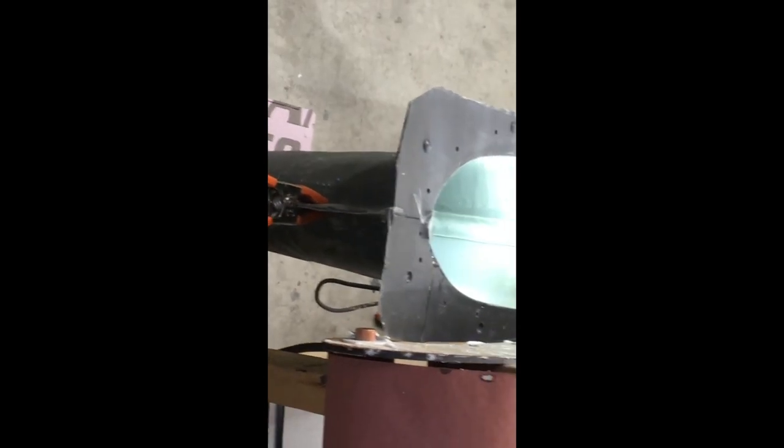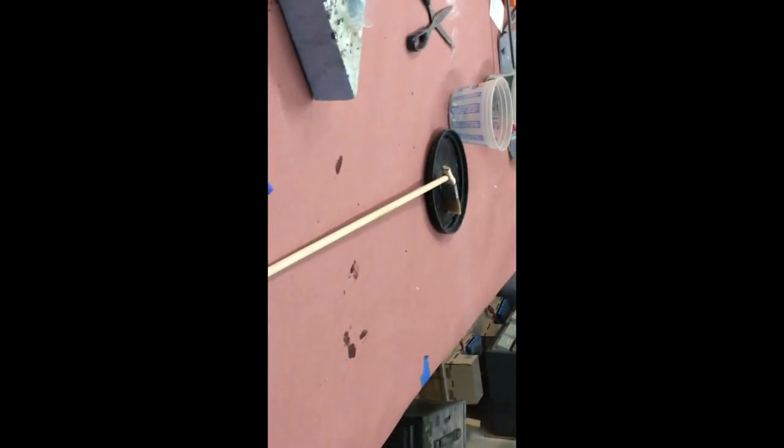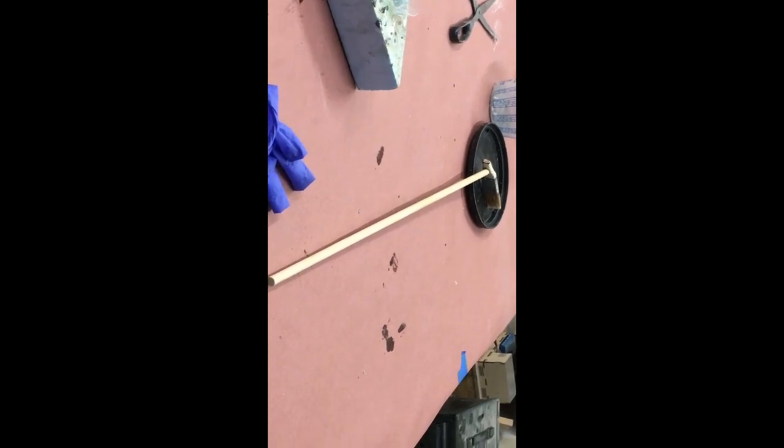The two halves are now joined. I was able to put about four inches of tape near the tail end — wetting the brush, sticking the tape on and just dropping it down until it's stuck — and there's a nice taped edge all the way up, nicely wetted out even though it doesn't look it because of all the splooge. I simply put the tail section vertical so gravity was with me, then guided it with the brush tool to get the resin on — perfect joint.